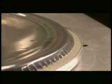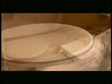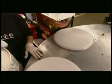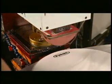Slightly less than half of all drumheads receive a textured coating on the surface that produces a swoosh sound when played under brushes. The even motion of the conveyor and spinning fixtures allows for a consistent coating across the surface of the head. Once the coating dries, a pad printing machine stamps on the Evans logo. The heads are now complete and ready to be packaged.